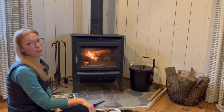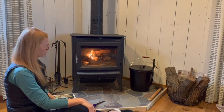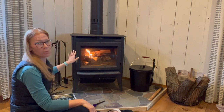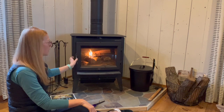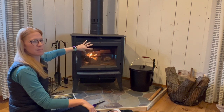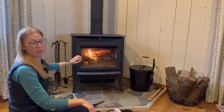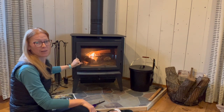When you go to reload the stove, you will open the bypass and the air control before opening the door, then just crack the door open a little bit. You'll kind of see it suck the ash back a little bit so it doesn't all come at you — that's the best way to open it to reload it.